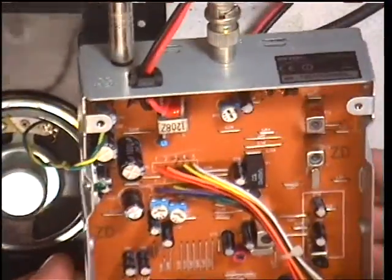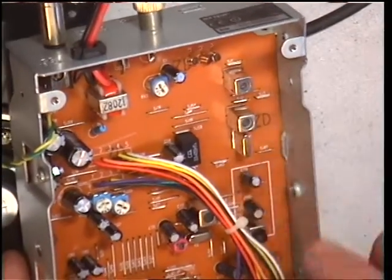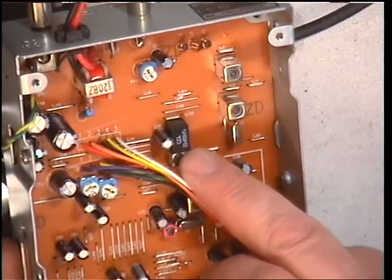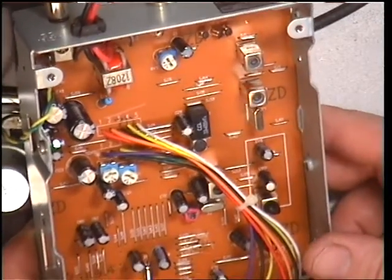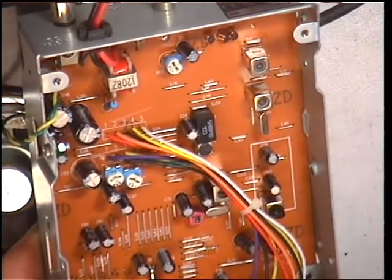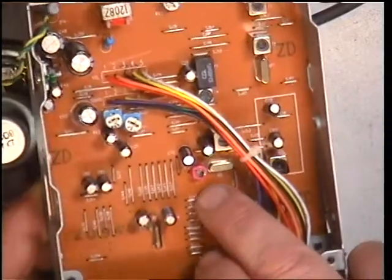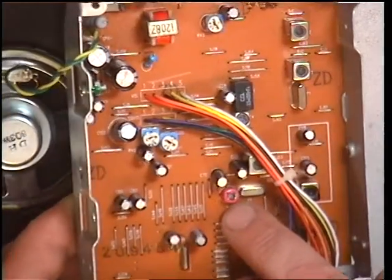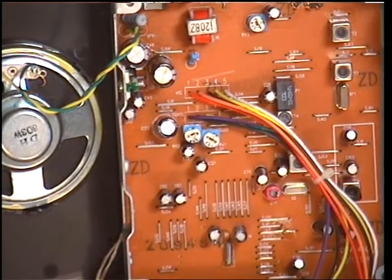In fact, you'll see there that's a crystal filter. So you've got ceramic for the 455, you've got a crystal filter for 10.695 - so that's quite impressive. And then the frequency will be set with that there. Now to do that, we'll be having to use a marker oscillator, so we'll come to that.